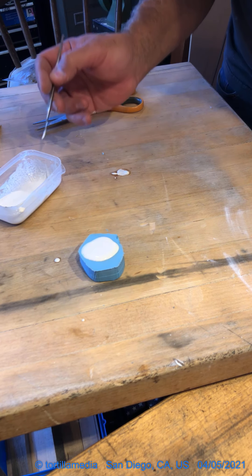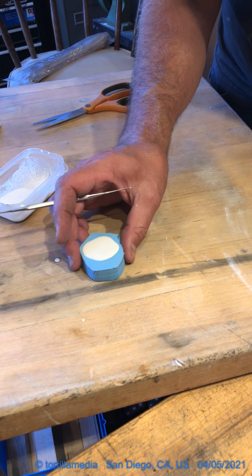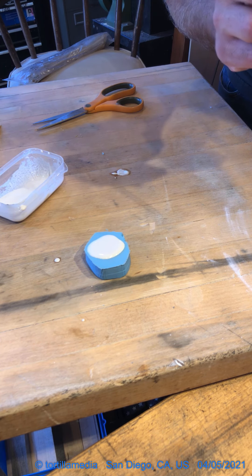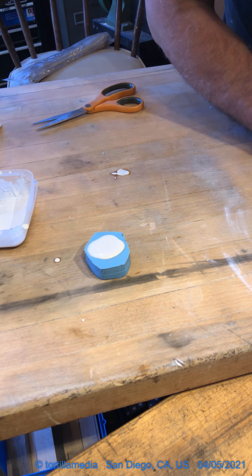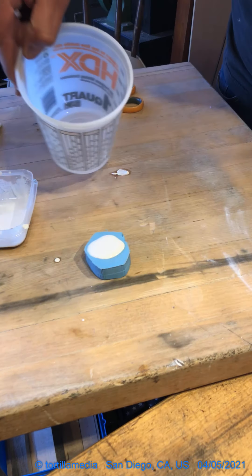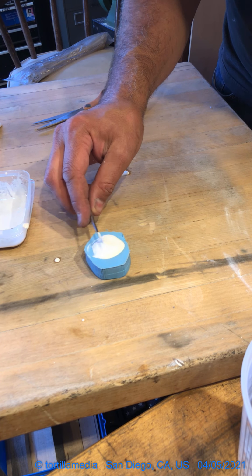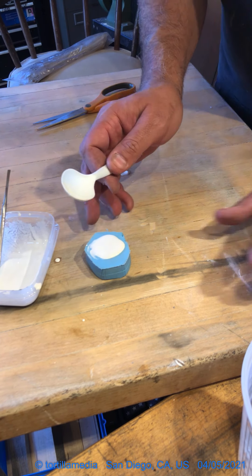This is the exact reason why you should never ever clean your stuff in your sink, because the plaster will set up underwater. That means you will not be able to snake it out or dissolve it out with acids — you will have to change your plumbing. Please create a separate bucket with some water so you can do a pre-cleanup, and then once everything's more or less taken care of, you can use your sink to wash your hands.